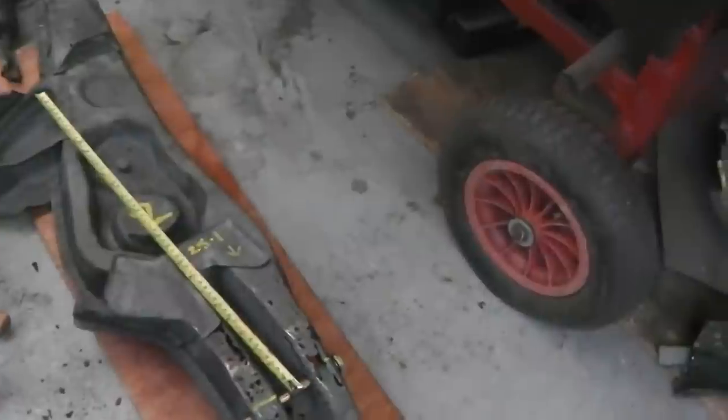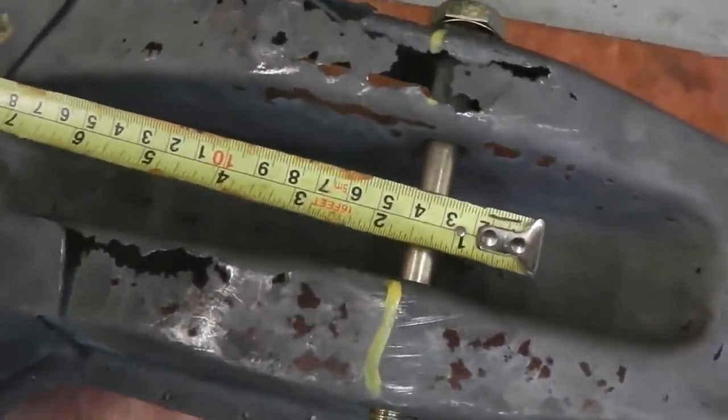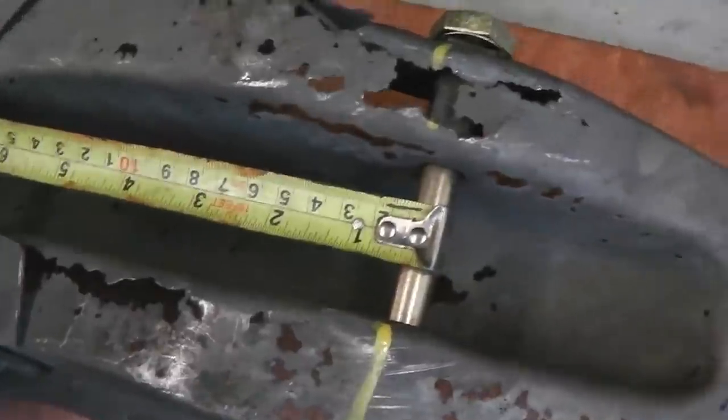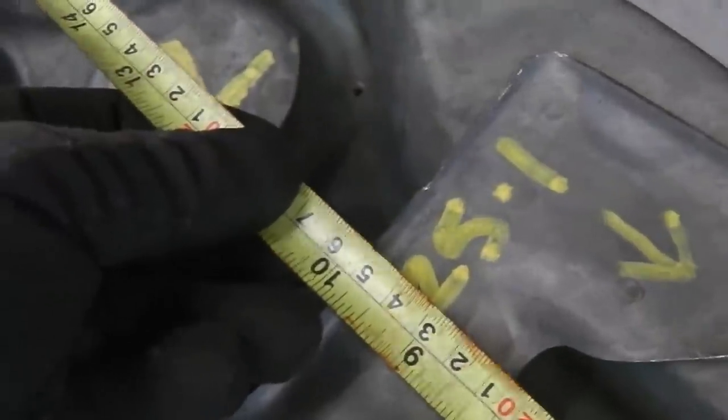Okay, we're chopped. And now, a bolt through the old piece of metal, the old chassis section. Pull the end of the tape measure tight against the bolt and measure that back bracket, giving us 25.1 mil. So all we have to do when we fit this piece, put the bolt in, bring it backwards and forwards till we get 25.1, and because we're going to cut it slightly short, there'll be room to move it, but we'll have plates under here that'll slide in and out, and then we'll get a very nice continuous weld on it. It's going to have to be strong.